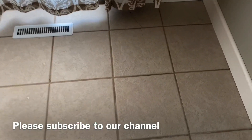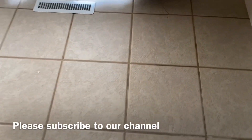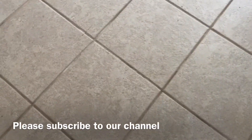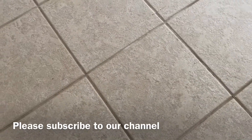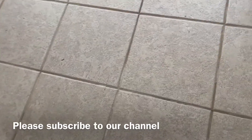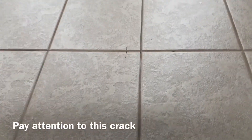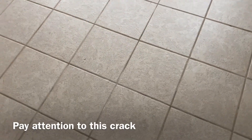We'll take a look here. You can see a hairline crack there. You can probably tell there's missing grout and how the grout is kind of coming out. I don't think the backer board was thinsetted properly, and I know it wasn't taped. We pulled up another room before. You can also barely see this hairline crack that runs along that edge.